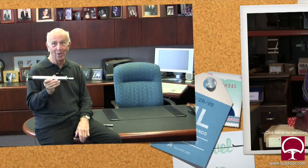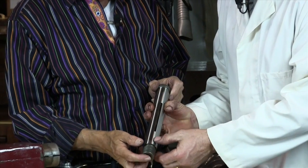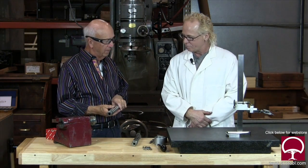Some of you are probably wondering how we got this concentric with the taper, because we didn't really explain that before going to the OD grinder. We took the original piece — which we know is in pretty decent shape — put lapping compound on it, went in there and lapped it in the lathe, cleaned it out, then took a brand new one we know is in great shape, put it in there, and tapped it in. That's how we got it concentric with the OD. We put our driving dog on and put it in the OD grinder — it's going to come out within half a thousandth or so, which is plenty good.